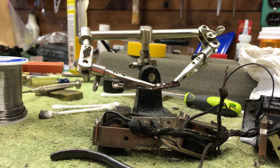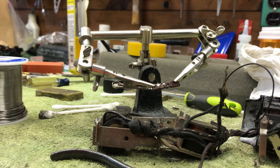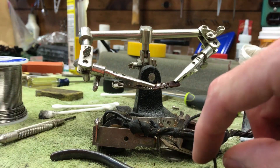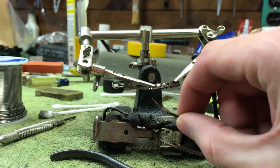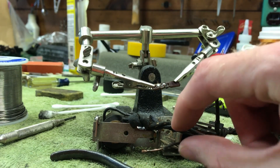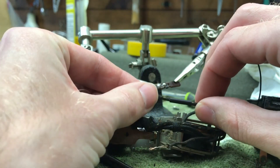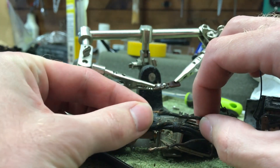I was able to repair the plate that holds the two fingers on by super gluing it back together, and the super glue seems to adhere pretty well to that old phenolic material. I also sanded off the tarnish and reflowed the solder on one of the soldering points. These old wires are also quite tarnished, so I just rubbed some sandpaper over them to get rid of some of the oxidization. That should help solder stick to them a lot easier. I'll be able to tin this and the other one. I'm also adding a tiny piece of heat shrink on each one so that will keep the ends of the wires from the cloth from fraying any more than they already are.